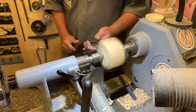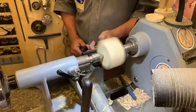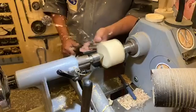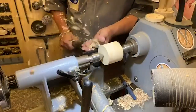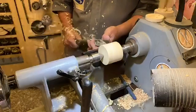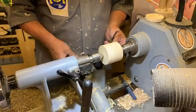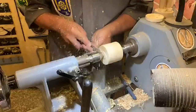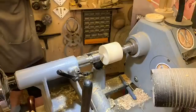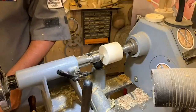We'll start with a roughing gouge down to the cylinder first. Dimensions: 53mm, and again I've given it a 10mm thickness but it's entirely up to you. So that's the roughing gouge done — now we can clean that up with a parting tool. Readjust the tool rest — the height can stay the same. I'm going to clean this base up so it fits in the chuck nicely. We'll use the C jaws — my go-to set. Optimum size on a C jaw internal is 58mm.